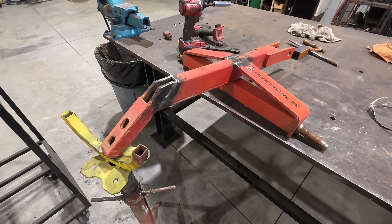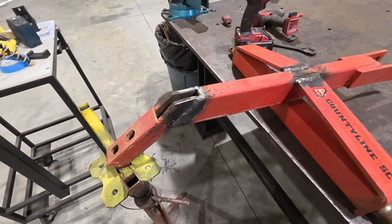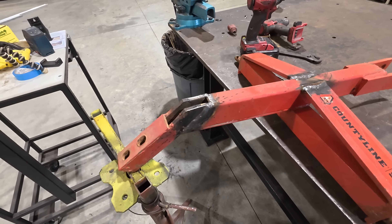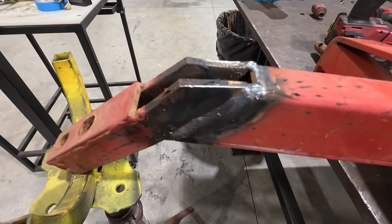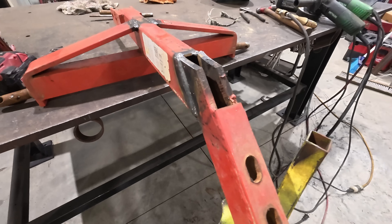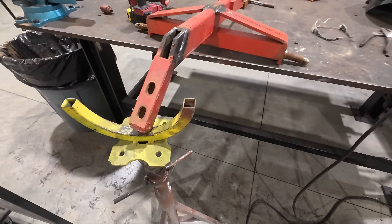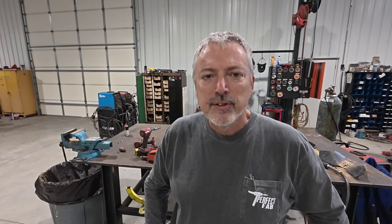So that took probably 45 minutes to do this repair. Those cracks wouldn't have broken — it was just the paint that was cracked where it was stressed — but I still ground it out and re-welded those areas. I have a lot more confidence in this now. It's not a great design to begin with, but it's just a cheap little plow for a little tractor, so we're not going to reinvent the wheel. I hope you got something out of this video. Your MIG welder is not dangerous, but the way you're using it very well could be. Pay attention to the mill scale, your fit-up, and your settings. Take the time and do it right. I appreciate you watching — give me a like and subscribe, and remember, you were made for a purpose. We'll catch you on the next one.